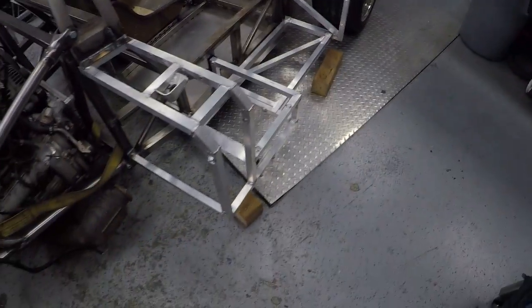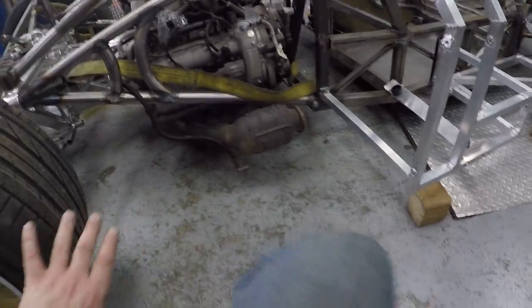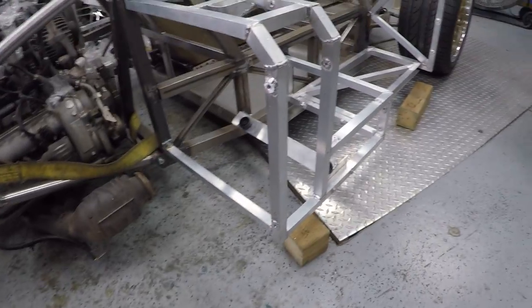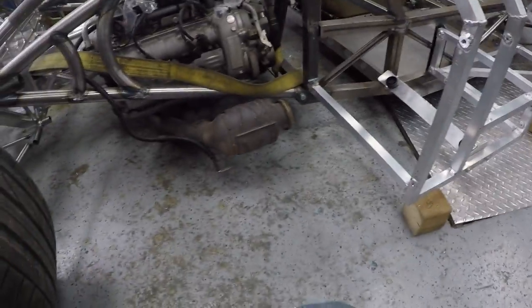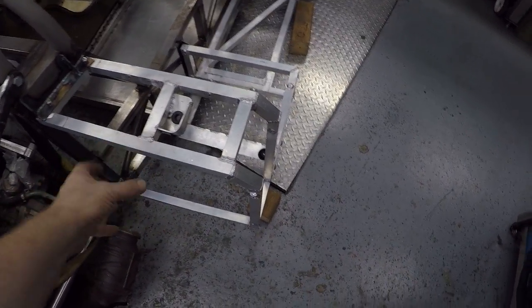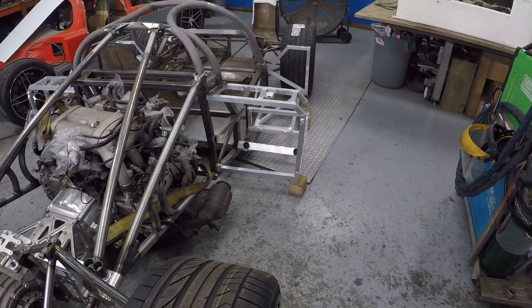Now this isn't all the frame. Technically there's a bit of bodywork between the wheel and the rest of the arch. But this panel where the exhaust exit is - I'm thinking originally it's actually a metal panel, not fiberglass like the rest of the car. I've seen that on a couple of vehicles. Either way around it's going to bolt in here and here and we'll make an extension piece that will come down from that to here just to give it height support. Then we'll probably tee in here where the wheel arch is back up to the frame just to give it a bit of extra protection. And here itself we'll also have the rear body catch, so we'll have a plate that comes off of that to the catch just to make sure we're not tugging on fiberglass, we're going to be tugging on the frames.